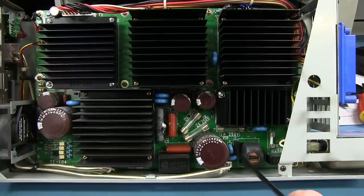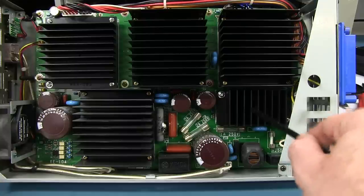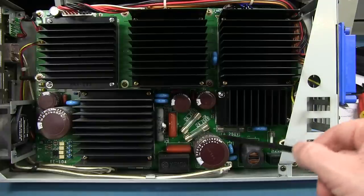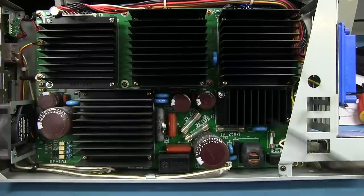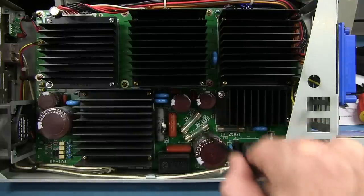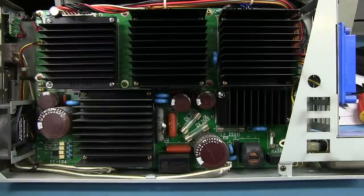that's obviously not the bridge rectifier. No, haven't found the bridge rectifier yet, so I don't know. Maybe it's this. This is our input bridge. This is probably our input bridge rectifier here. This is our main 450 volt 470 microfarad filter cap. So converting mains input, rectifying it, converting it directly to DC. Nice artistic angling on the fuses there. I rather like that. Neat.